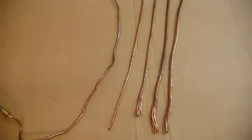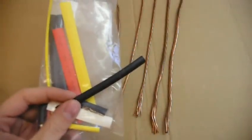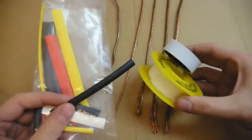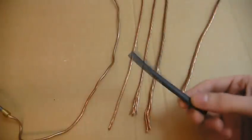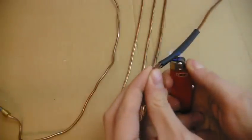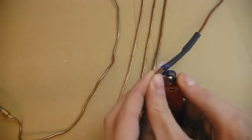The next best, especially for thick wire, is to buy or salvage bare wire or strip some junk wire and then cover it with either heat shrink tubing or Teflon tape. This is actually cheaper than buying insulated wire, and better. You'll want to buy your heat shrink on a roll, not the cut up 6-inch pieces, and it only costs about 20 cents a foot from your favorite auction website.